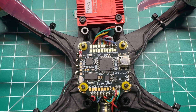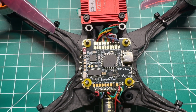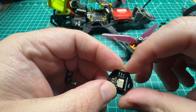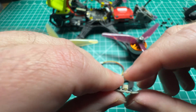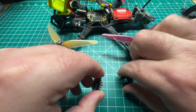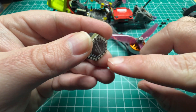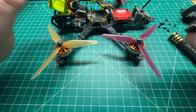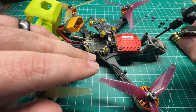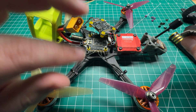It's going to be a little more difficult because I've already built the quad. Typically you would do this beforehand, but I don't think they had this released when I built it. Here's the little LED we're going to install — it's got a plug, but also has pads if you wanted to solder it up or in case you damage the connector. We'll cut off one end and solder it up. It has a little mount that insulates it from the flight controller, so it faces down. The transparent TPU — you can see through it. I'm going to have to lift the ESC up, wiggle it into the space, then solder the rest up and verify it works.